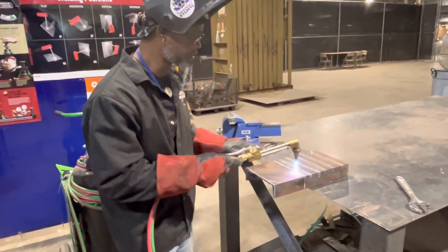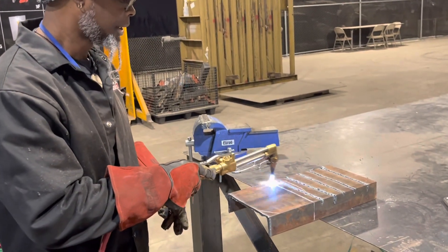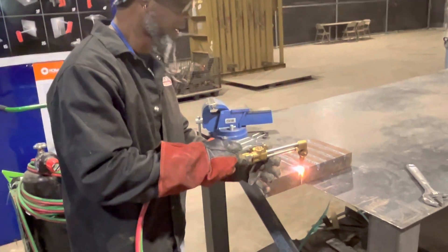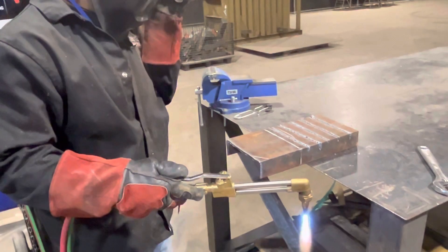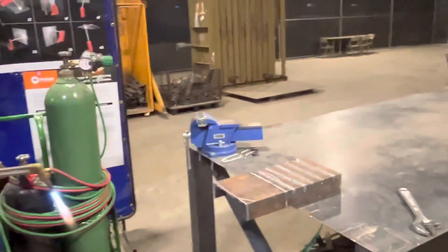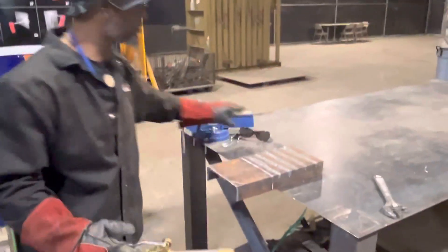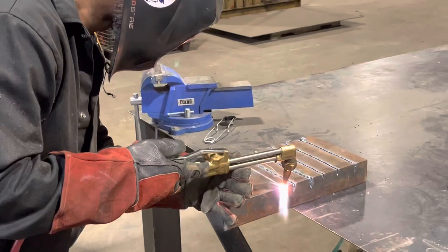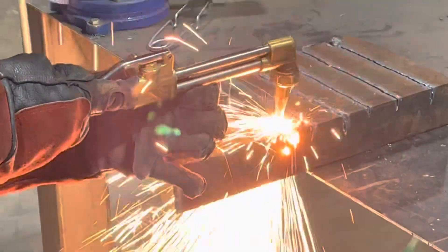Before you get started, no matter what you're doing or cutting on, always preheat it. I've got a piece of soapstone line on here. I'm going to preheat this piece and run it a couple of times just to make sure it's warm. Once you get to the end where you're going to cut, you want to make sure it's got a fire-red tip — make sure it's good and fire red. I've got my welding hood on, and you want to get yourself some cutting glasses. My welding hood has a transition lens so I can use that. Make sure you've got all your proper PPE.